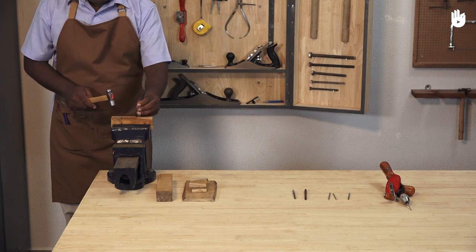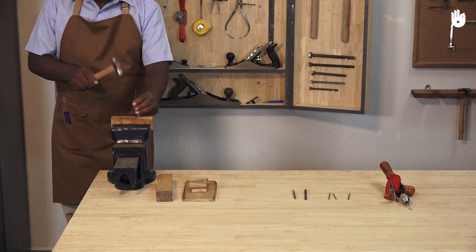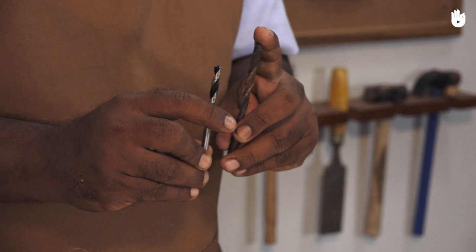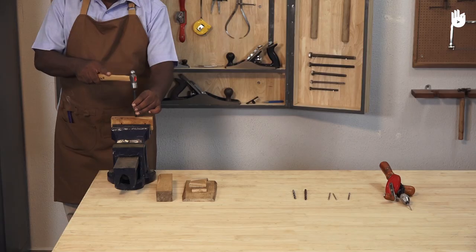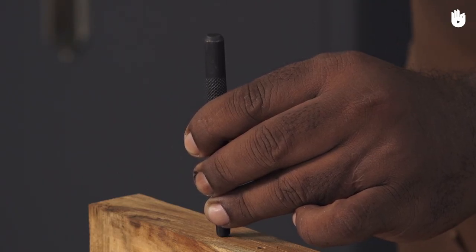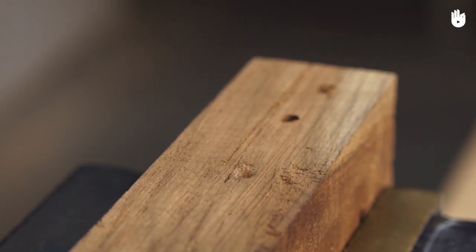People sometimes use a drill bit for metal and woodworking, as they don't have a brad point. You can clearly see the difference between the brad point and the normal drill bit for metal. As the normal drill bit doesn't have a sharp tip, you need to use a center punch and a hammer to make a small hole for the drill. This pilot hole will prevent the drill from slipping.